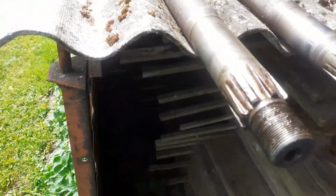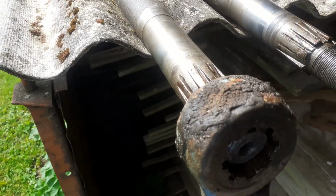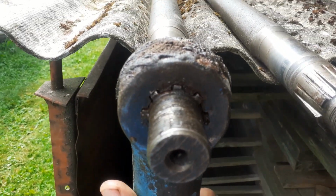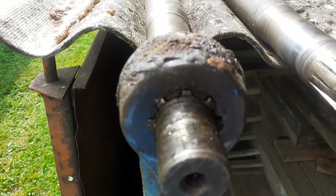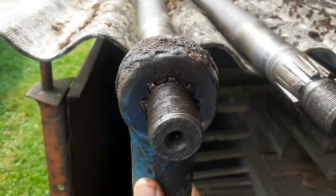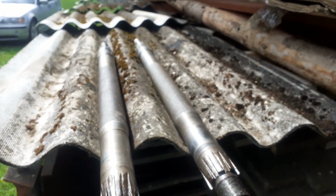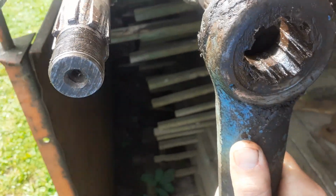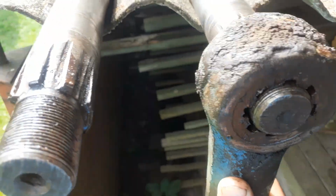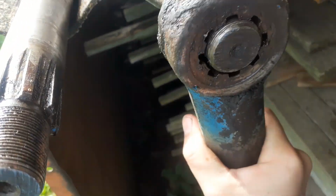This is the vertical shaft that came out from that steering bolster. Now I'm going to put this one on, and I don't know if you can see this from the video, but the splines in the pitman arm and on the vertical shaft are completely worn out. And I do have another shaft that has some funky issues as well. It goes to the splines really tight, way too tight even. But let me show you if I can get it there.